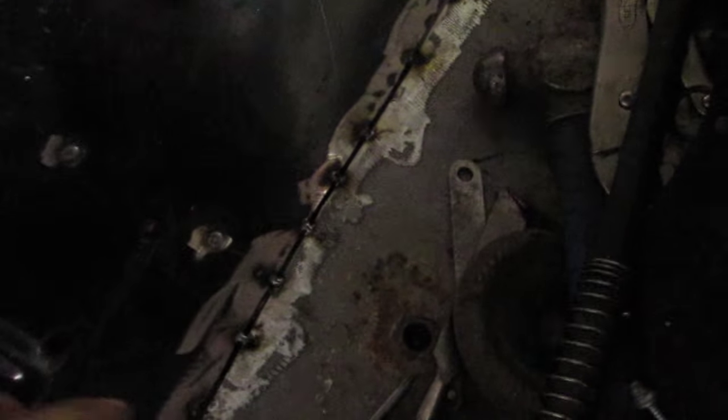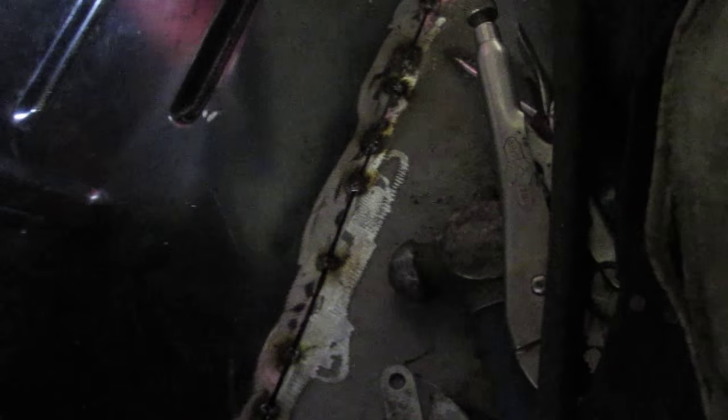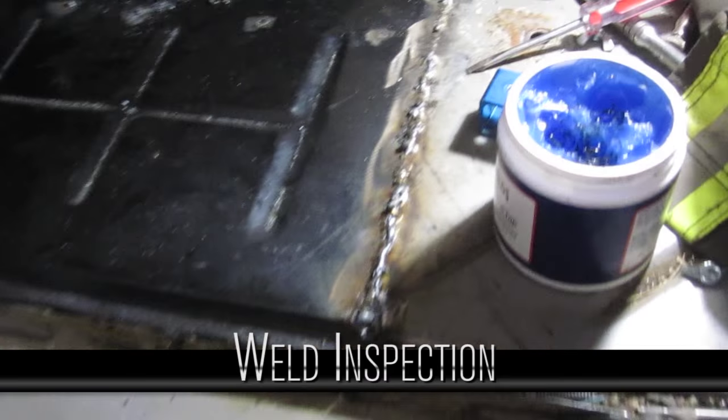Once you have tacks every couple of inches, you can work off those tacks really nicely. You can use a blow gun to cool the weld right after you weld — that helps with warpage. You only want to spot weld every couple of inches to keep the heat down to a minimum so you can still touch it, which helps with warpage. This is going to take a while spot welding all the way around, but she'll be 100% when she's done. This is three hours of tack welding all the way around.